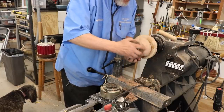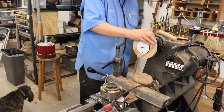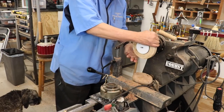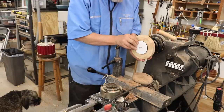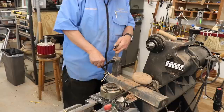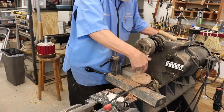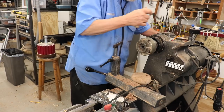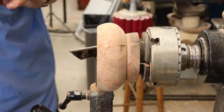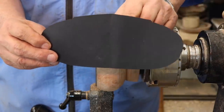I'm showing you an area that I spent quite a bit of time filling with some sawdust and CA glue — it was a bark inclusion that was just going to interfere with the profile of my base. I'm going to tilt the tail stock away. That pendant control unit on a cord is very, very handy — I can put it in a place that's safe and I can get to it very easily. I've got this mounted on a screw chuck and I'm taking this off, putting my scroll chuck in there — it's a Vicmarc 120 with two-inch jaws. I have my lathe turning in reverse, take the screw chuck off, put my scroll chuck on the spindle in preparation for hollowing out the top of the base.